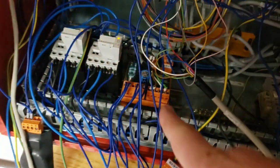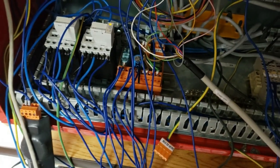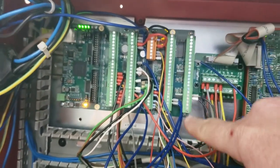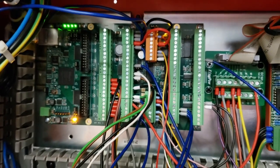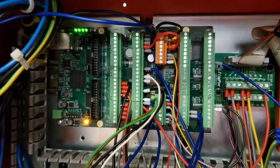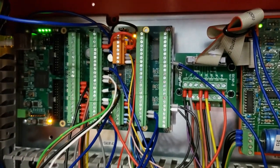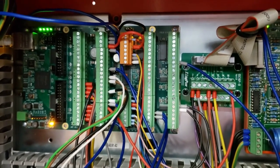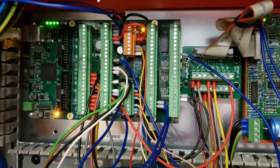This board: 24-volt in, 24-volt relay, 5-volt encoder. Field IO on the 7i76 series — if you've got 24 volts going in, it wants to see 24 volts, or a threshold thereabouts — there's like a fluff factor. Depending on what your input voltage is for your field IO, say you've got 24 volts: your low-point threshold is like 14 or 18 volts. After that it doesn't see it. So if you've got 8 or 10 volts coming in, you can get down lower, but you can't go higher.